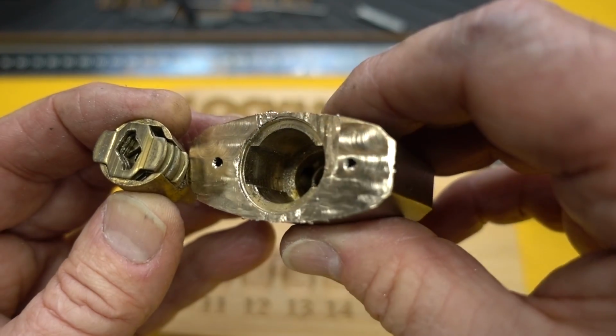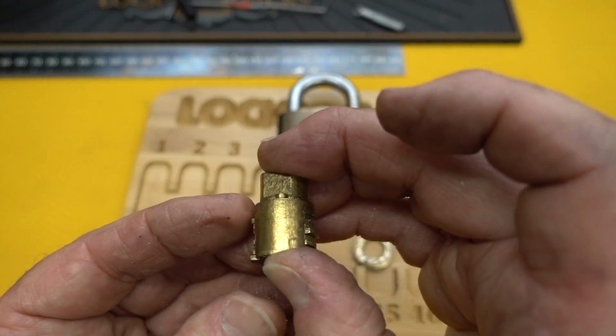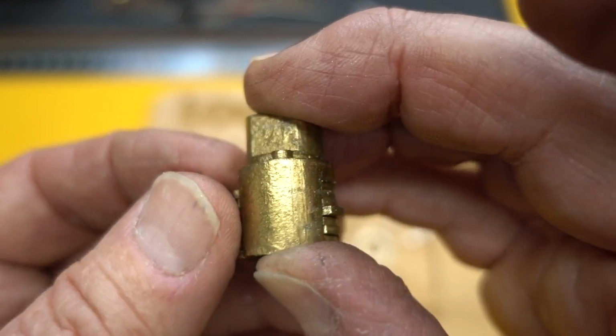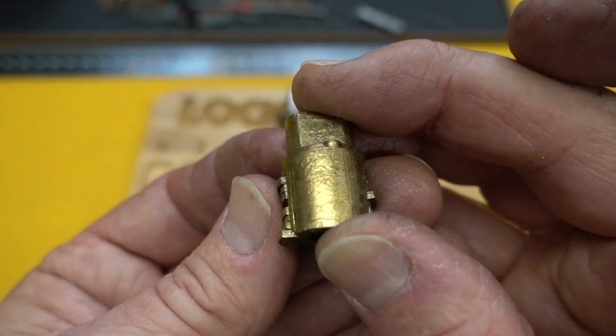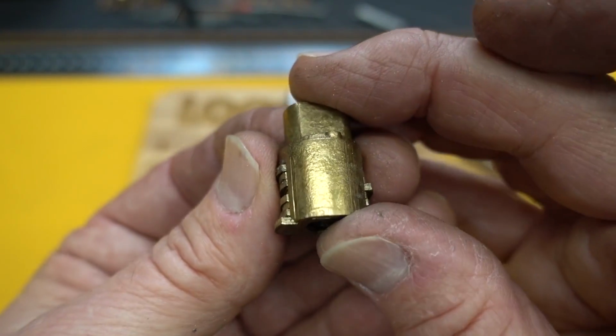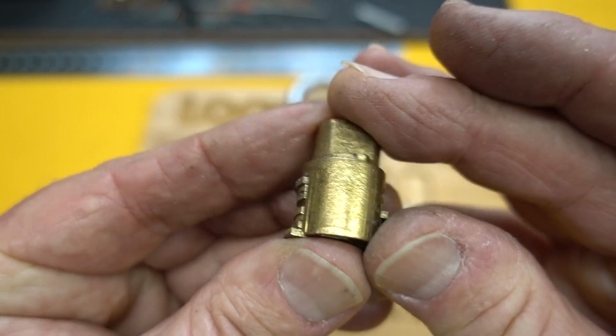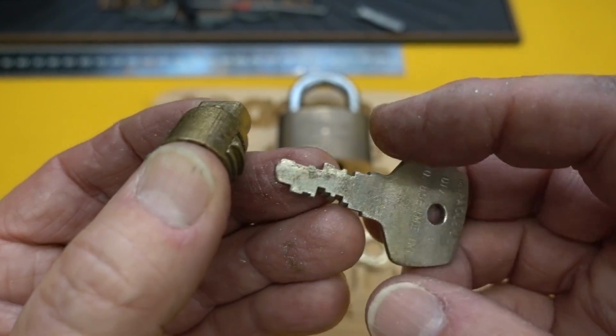Okay, there are the cutouts on both sides of that lock that those wafers protrude into. And you can see from the top of this how they stick out from both sides to prevent rotating that core. You are never going to shear those things off. So you're not going to be brute forcing this. The only way to do it is to get those wafers perfectly aligned with one of these.